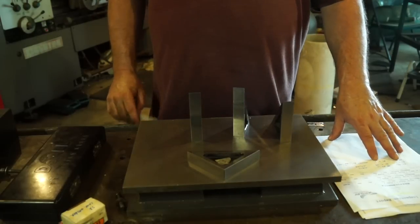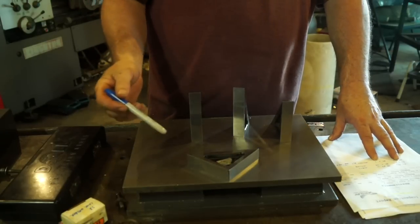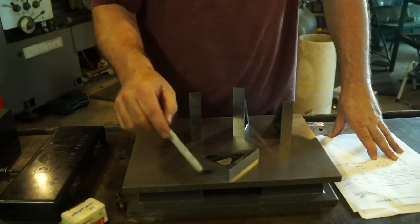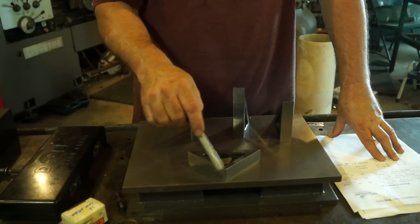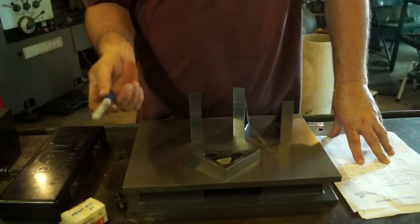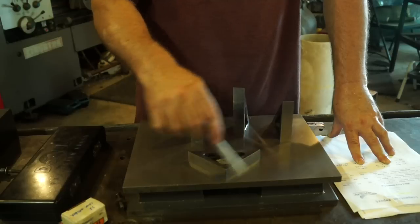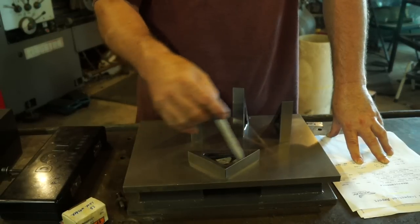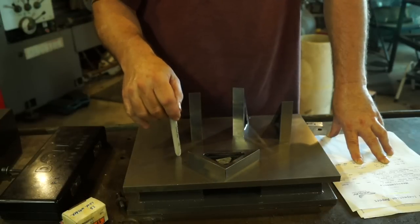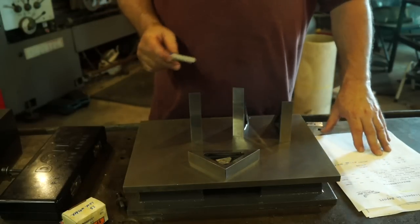The second angle — the 90-degree angle — I'm not sure which one it is, so I'll have to find out. The 90-degree angle turned out to be 90 degrees, 0 minutes, and 43 seconds, which comes out to be seven-tenths. So one side of this angle relative to the other is seven-tenths off in five inches. That's what I think created the problem with the 45 on that end.